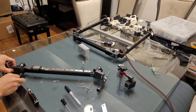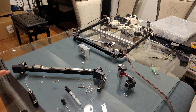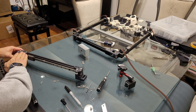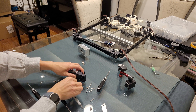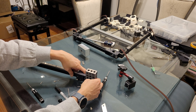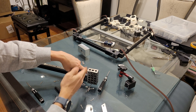I install the linear rail by pushing it against the 3D printed part — sometimes it goes crooked, so I make sure to put it straight before tightening the screw. Flush the beam members together; you may need someone to help push it. I tighten the bottom first to press it down to the bottom surface of the 3D printed part, then make sure it's square to the 1-2-3 block and push it together before tightening.